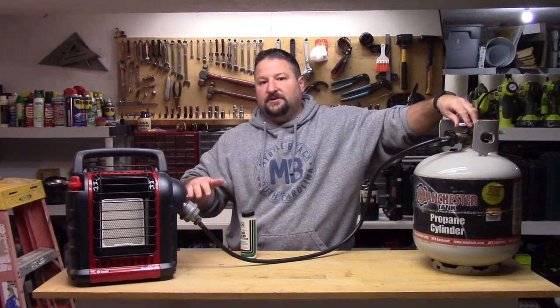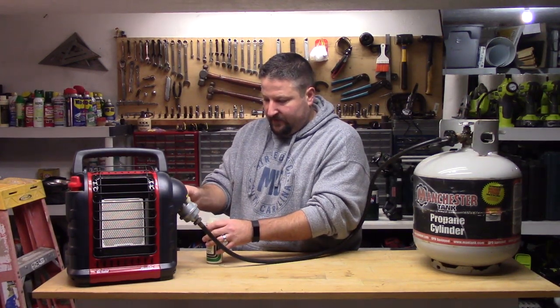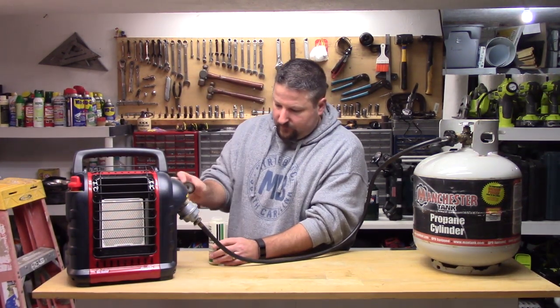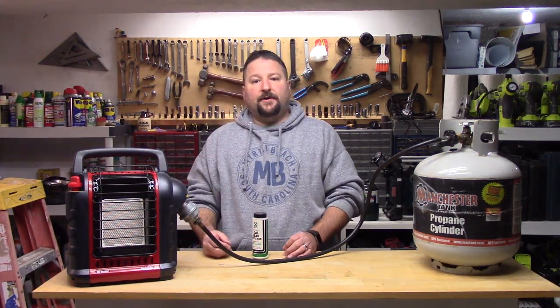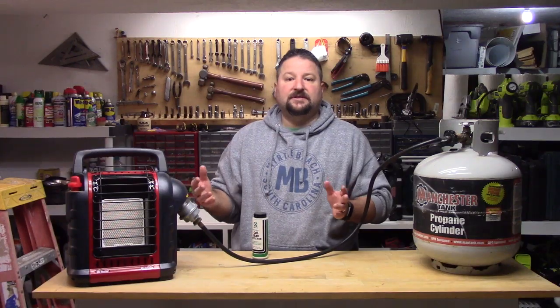and I just heard it pressurize the line, I would start to see bubbles. So we're going to check our fitting here, and we're going to check around here. Now if you don't have gas leak detector, you can use soapy water. Make it really soapy, a little bit of water, and if you have a brush or some kind of an applicator, just apply it to that and it'll do the same thing.